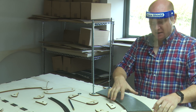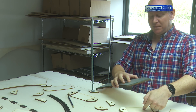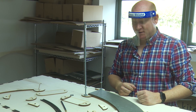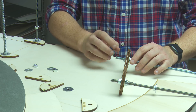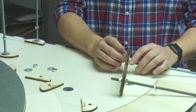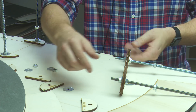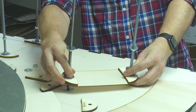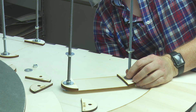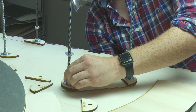Now we move on to the second set of threaded rods, with more nuts and bolts. We'll glue the baseboard to the base plate — when all the nuts are locked it holds everything tight — and then mirror that as we go around the full 360 degrees. On these second rods we put one nut up to the base of the plate; this sets the minimal rise from the offset, starting the gradient into the helix. Two washers sit over the holes, then the rod goes into the baseboard with nuts and washers underneath, again not over-tight.